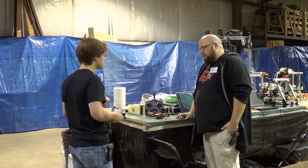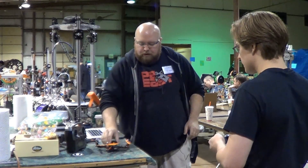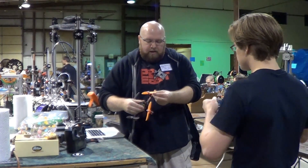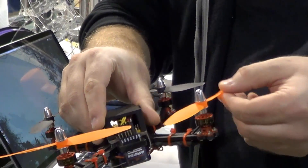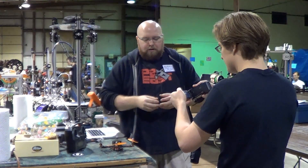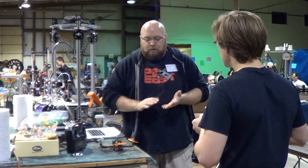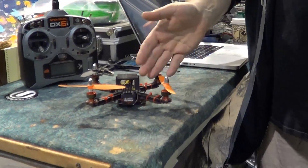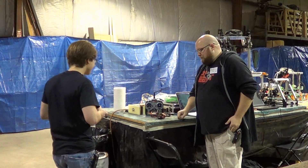And there's a reason you can't print the blades, right? You can, but it's very difficult. The blades don't have a nice flat place to lay — they have a pitch to them, that's how they work. So you'd have to print with lots of support material and rafts and do a lot of post work. And you can buy a bag of these for $4 or $5, so it's not really worth the effort for the cost.